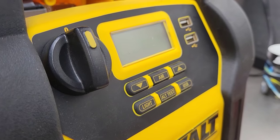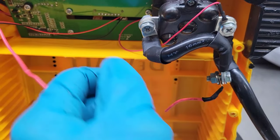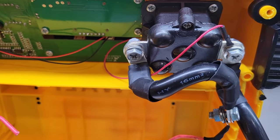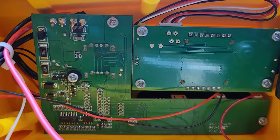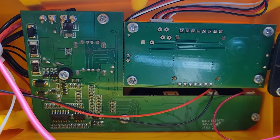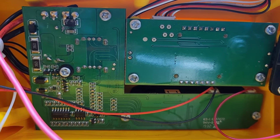And on the outside, that's your off-on switch. And if you open it up, this is where it hooks up to the positive terminal of the battery. Again, same as the battery. You want to make sure these connections are clean and tight. And if when you open it up you see any circuit boards, just take a good close look. See if you see any evidence of arcing, any burn marks. Again, even use your nose if you smell anything that's been burnt.